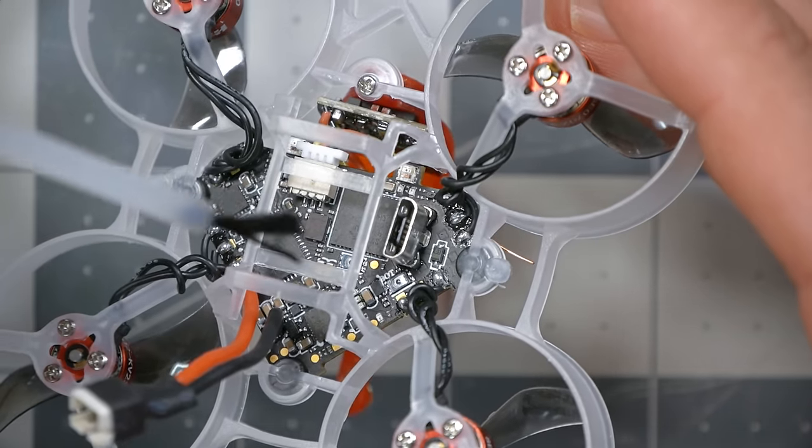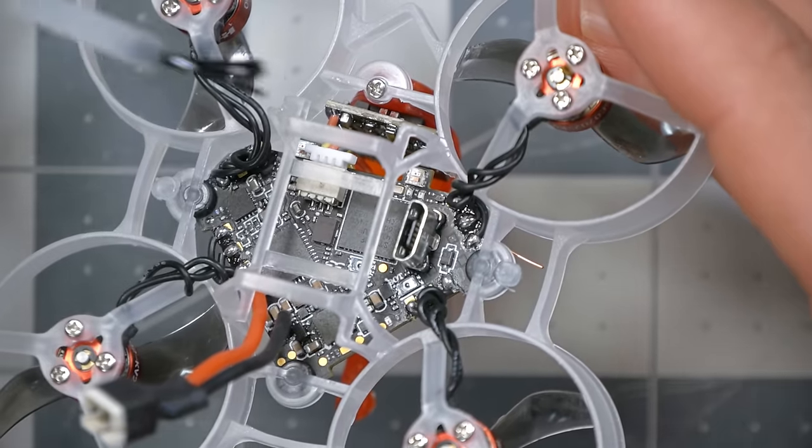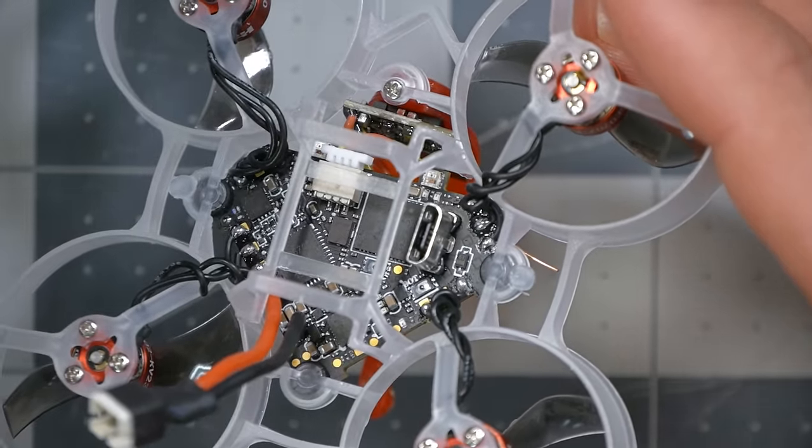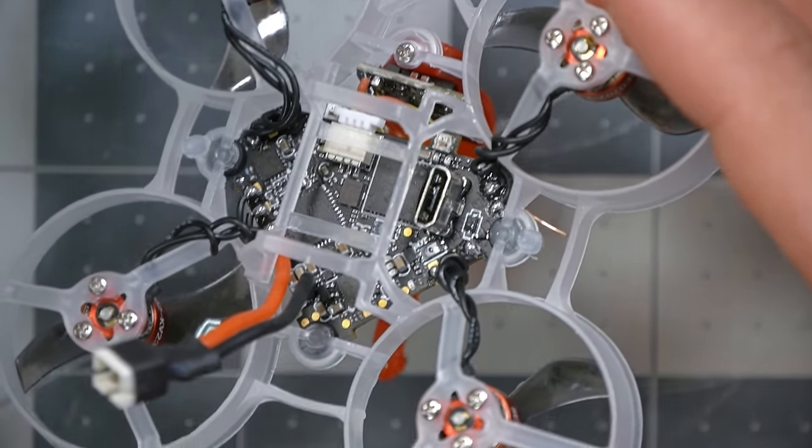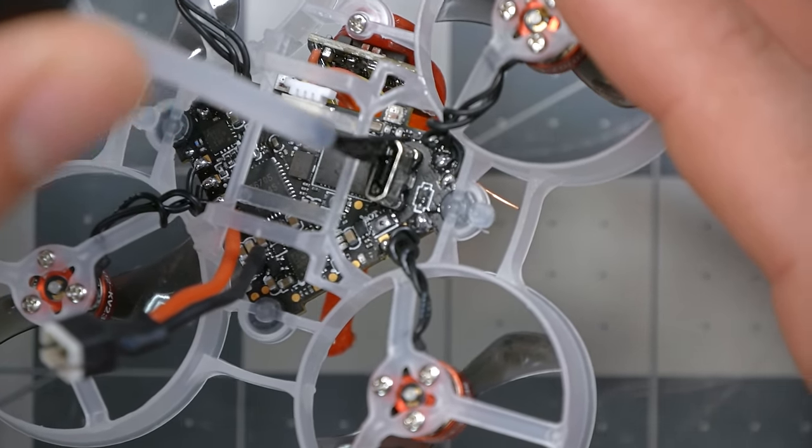You're basically trying to stack the odds in your favor. It's really difficult or impossible to completely waterproof a drone without basically encasing the whole thing in some kind of container. These paint-on sprays can only go so far, but oftentimes it will be enough. As we come to the underside of the board here, I'm going to make a mistake that I don't want you to make. I am going to get conformal coating into the USB port and really goop it in there to make my point very clearly.